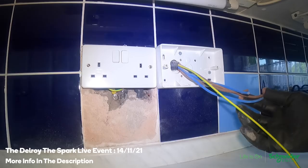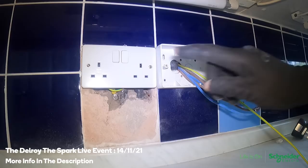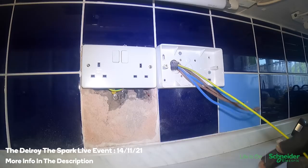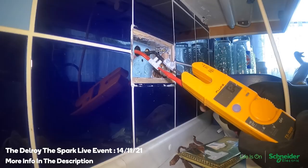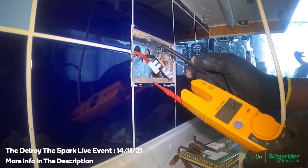That's where I've got to so far. Let's go put my box up and I'll have a socket. I've continued dealing with the neutral and the live, but obviously the earth couldn't do that. Although this and this is going to be earthed, because of the disconnection here, you're going to have problems in another part of the circuit — might need to rewire some part of it. I know that this is going to be earthed — I'll test it after to make sure. Good earth confirmed. I'm going to do my own ZS test. Just need a blank plate for this one. That's the 1.5mm 3-core in earth they used — that's all dead now. All I need to do is put a blank plate on that. Now I'll move on to the light in the bathroom.